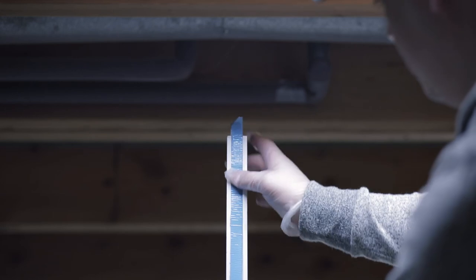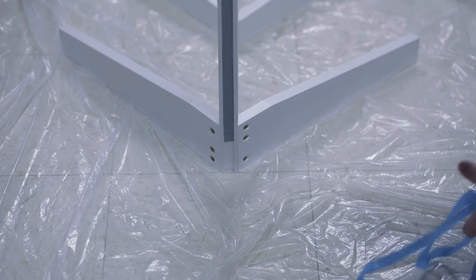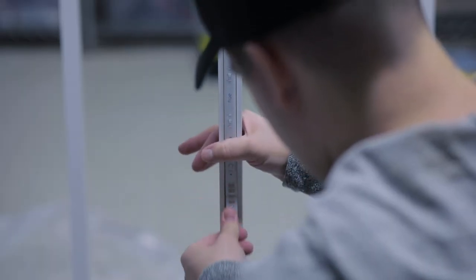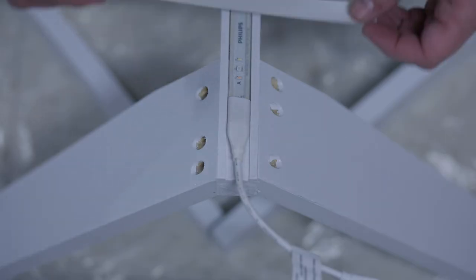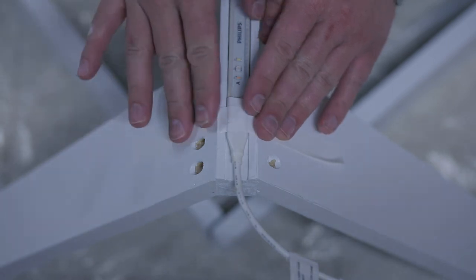After painting there were a few more steps to go, and they all centered around attaching the LED strips themselves. Even though my strips came with some sort of stick-on backing I wasn't all that excited about using it — I wanted to be able to reuse the strips in the future and wasn't thrilled about using up that built-in tape. What I did instead was attach a strip of double-sided tape to the inside of my routed channel, which I had cut to the perfect width to fit. I peeled that top layer off and just stuck my LED lights — backing tape and all — onto that new double-sided tape. That worked out pretty well; it hasn't been all that long but the tape is holding strong. If it does fail in the future I'll probably just pick up some mounting clips or sacrifice the built-in glue strip on the lights themselves. The last thing to mention is that I did use a piece of electrical tape just to keep the very bottom of the strip from peeling up and loosening the whole thing.